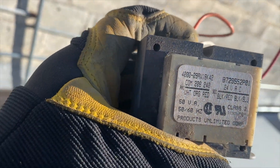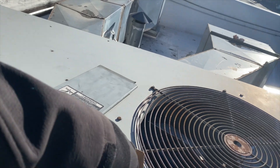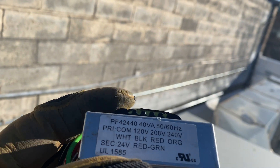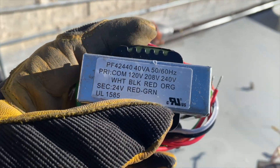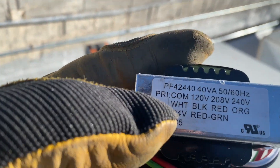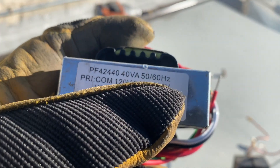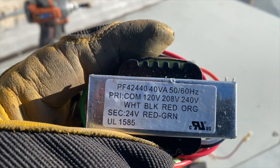We need to see what voltage we need — it's 240. The old one was using white and red, so that's 240 volts. I don't have a 50 VA transformer, only a 40, but it's close enough. More than likely I'll come back and put in a 50, but it's Sunday and everything's closed. This universal transformer: red and green is the secondary side — that's our low voltage. The primary has options: 120, 208, or 240. For common it's the white wire — that's line two. For 240, line one uses orange. So we're using white and orange for high voltage, and red and green for low voltage.